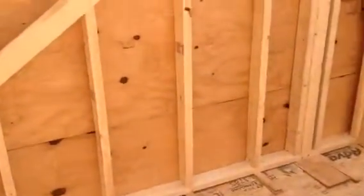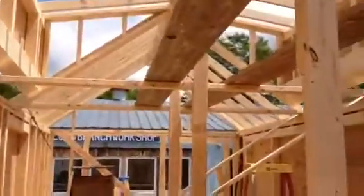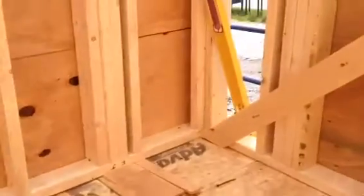Our tiny home build. I wanted to talk about leveling and straightening and squaring up the roof system. So, building a trailer and working with metal apparently is far different than working with wood. So you can see that the trailer dipped quite a bit in the middle, trailer framing. So the first thing we did is we leveled all four corners of the trailer using a transit.